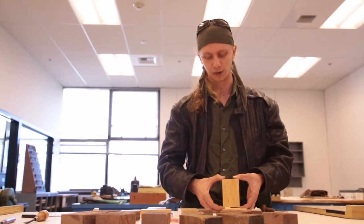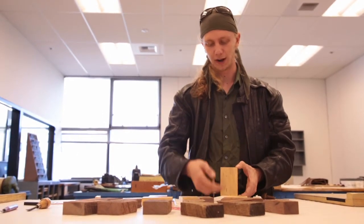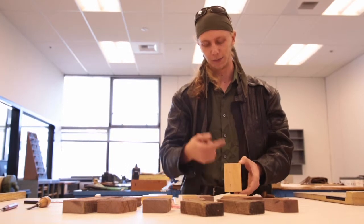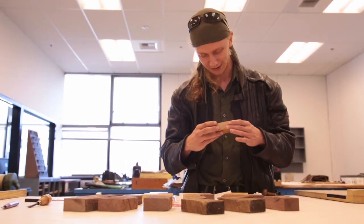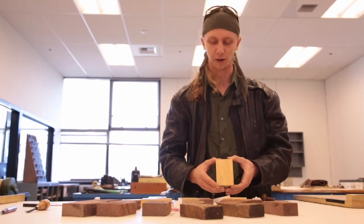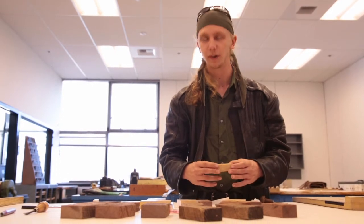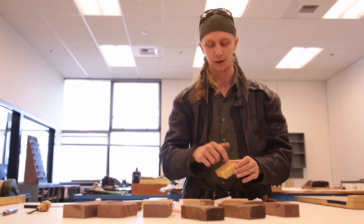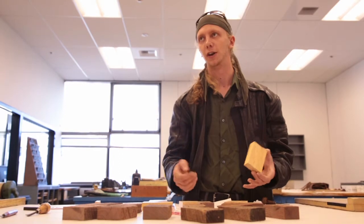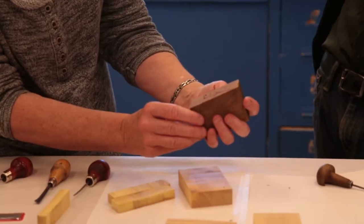As the tree actually grows, the rings are coming out, but the grain is moving this way. The water moves up and down through here, and you can't really tell on boxwood, but there's also medullary rays going the other direction, pulling grain the other way. And those you're not really going to notice affecting you in boxwood, but if you were carving oak, you'll find that those would be a harder spot. Boxwood should cut pretty smooth for you.